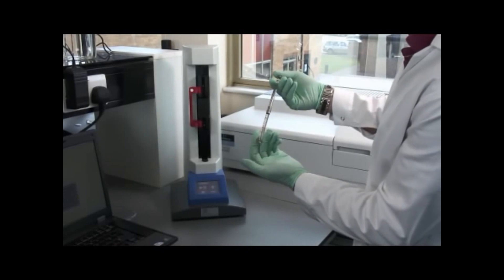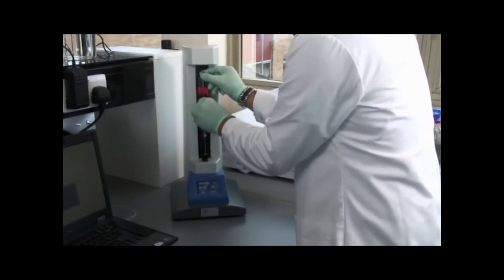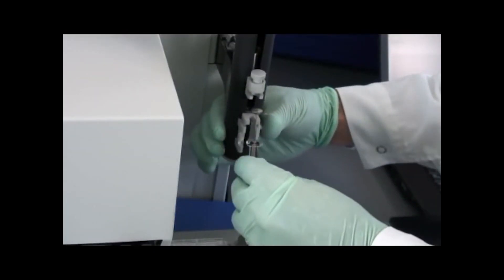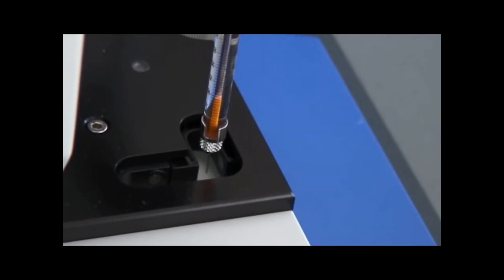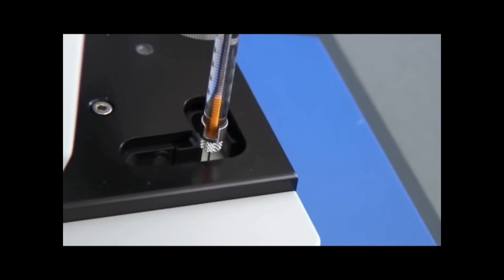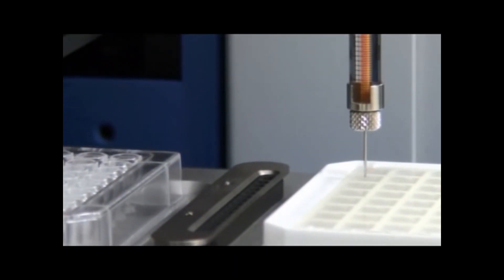As part of the collaboration, we realized there were some peripheral elements to LCP sample preparation that we could help with. So we developed an automated benchtop mixer. From there, we take the syringe of mixed LCP solution, add a dispense needle, and use the change syringe wizard in the software to load the syringe onto the instrument quickly and easily. We then use an auto-calibrate feature, which references the point of the needle tip for that specific syringe full of LCP, ensuring that drop placement is absolutely perfect every time.